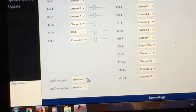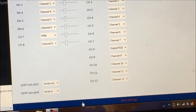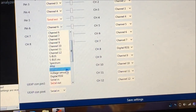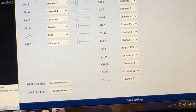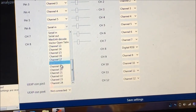Once you've set up the UXP serial out and serial in, click on Save Settings. If you connected the serial out to any of the PWM pins instead, you can set the serial out or serial in to that channel and change the others to 'not connected', then click Save Settings. I have pins 5 and 6 set for serial out (TX) and serial in (RX) respectively. Since I'm using the UXP port, I just convert this back to channel 5 and channel 6.